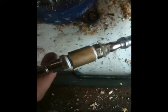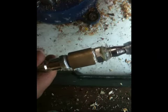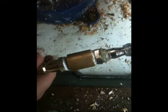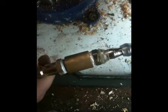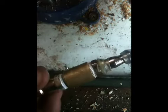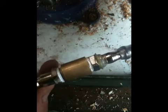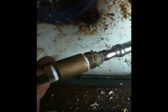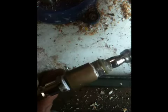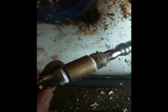So from this experiment today guys, I've learned the hard way — you need to have one of these before. So this is going to be in between your air filter and the flashback arrester, then the bubbler. You can see from my previous video how important these things are now, and it works a treat. The actual stainless steel wool you can get from any hardware store — it's just the stuff you would use for scrubbing your dishes with. You must get stainless steel obviously. I'm really pleased about that. The guy that sold me the flashback arrester on eBay — I've said thanks for his feedback on telling me what I needed to get this thing finished. I really appreciate that, and his flashback arrester works perfectly fine as you can see, with the right things used in conjunction with it.